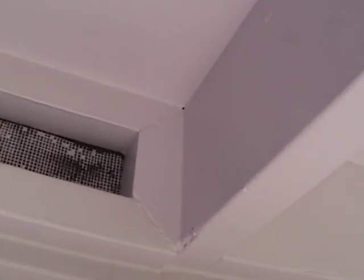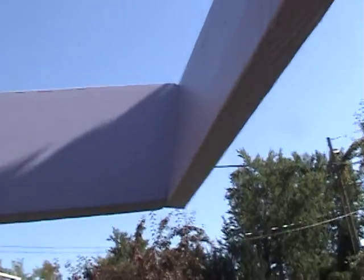And of course, you've got to remember this house is 45 years old. So this is what caulking does. When you caulk in all your joints like this, and people don't usually do it, they don't go to that much trouble. I've caulked in all the trim, everything else, and you can see there's a little hole right there. I'll put some caulk in that. And you can look over here, and this is sunk in a little bit. But if you go and fix these little problems with caulk, everything's been caulked, then you don't have a spider problem or a bug problem, because they don't have anywhere to hide. And they won't get up here in the rafters at all.